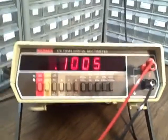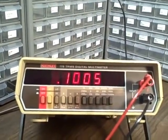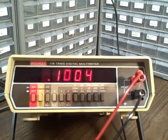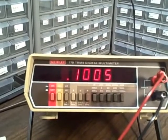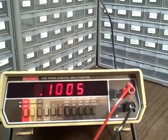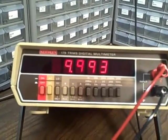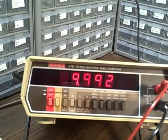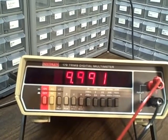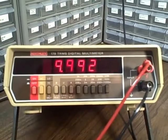We are connected to the box on the low ohms reading, 2K range. We have a 100 ohm, one percent resistor that should read between 99 and 101. We are reading 100.45 — right in the middle of that range, reading acceptably. Stepping up to the next position: this is a 10K resistor, and we are reading 9.992K. This 10K resistor is a 0.1% resistor and should read between 9.99 and 10.01. We are within the tolerance — on the low side, but within it.